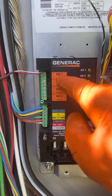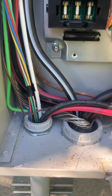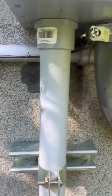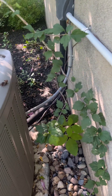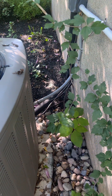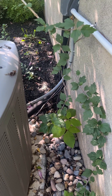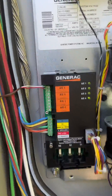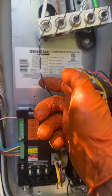This is like an automatic switch. You connect two wires up here, it runs down through here, goes under, and goes over to the thermostat control wires at the condenser. All you have to do is break that contact. On the transfer switch, we have a red and white, and think about it this way — you have this one wire right here at the condenser.